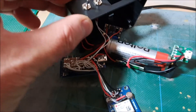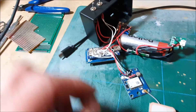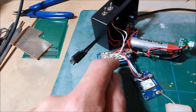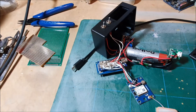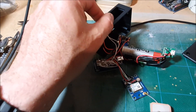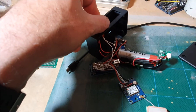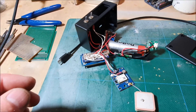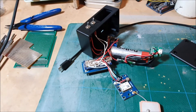There's a little piece of breadboard on the back just to make the wiring easier. There's an 18650 lithium-ion cell with a charging protection board hot-glued to the side, a micro USB input socket to charge it, and a little boost converter inside that steps up the 3.7 to 4 volts from the lithium-ion cell up to the 5 volts needed for the Arduino, the LED, and the GPS module. Then there are a couple of little toggle switches. I was going to put all of this into a bigger box but then decided to cram it into as small a case as I could, and it does all fit in there.